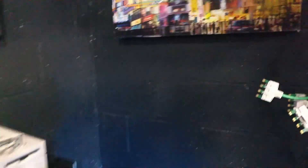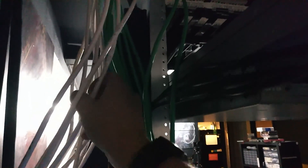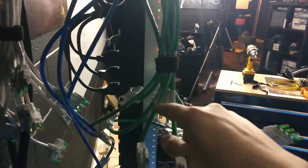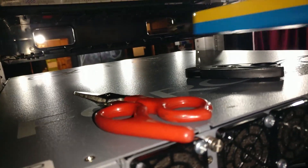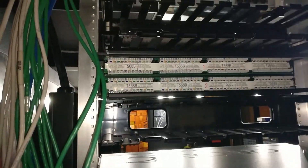That part's done. We've got our cables pulled up — I still gotta band them with some velcro along the way, but I'll do that when I'm done. You pull on each cable individually and it cleans up your cable lines. I'll go back through this once more and clean that up so it's not as tangled, but it's going to have this nice coiled wave to it. Once that's done I'm going to start with cable number one — clip it, strip it back, and punch it down. We've got all the tools for the job: scissors, cable strippers, and a punch tool.